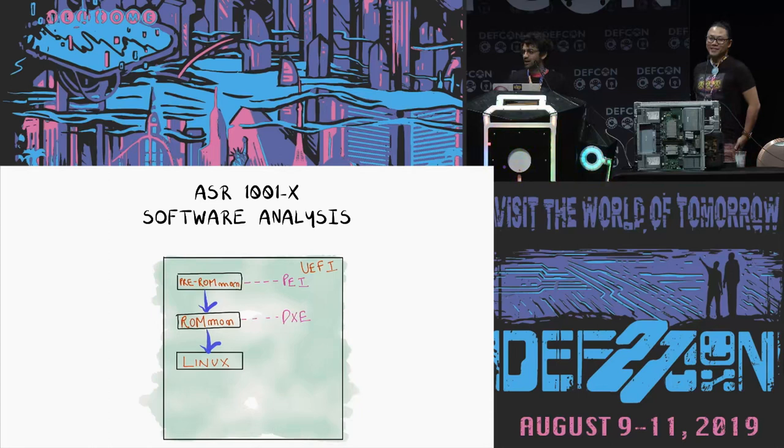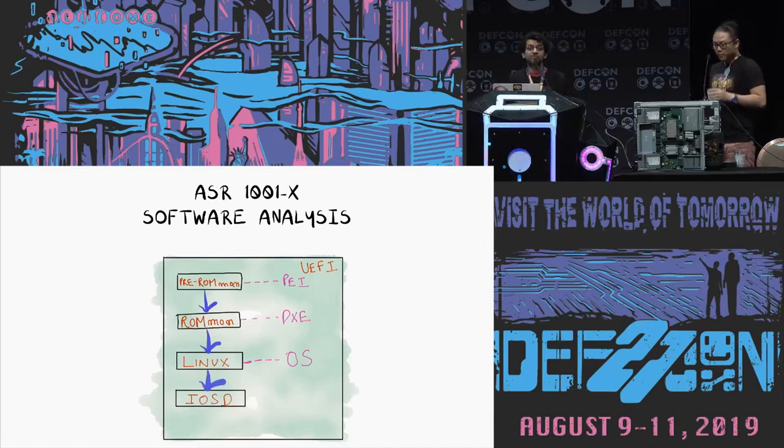So then comes the Linux kernel. They started using an off-the-shelf Linux kernel, on which they ported their own Cisco stack running as a privileged process. They also wrote a process manager which manages this process. So any kind of crash that happens in the IOS reboots the whole system. And once you combine this, this becomes your IOS XE stack. And if you go to their website, this is the most secure stack.